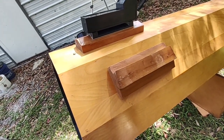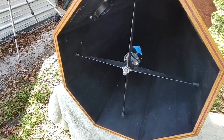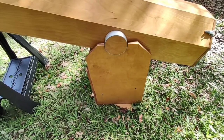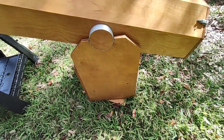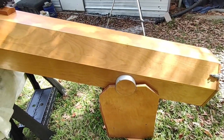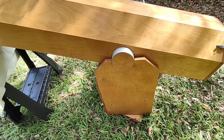I'm thinking there must have been a balance issue and they needed some weight up at the top. The spider is adequate and the secondary mirror holder is adequate — we don't have to do anything with those. The altitude bearings, by today's standards, are very, very wimpy in diameter. They need to be much bigger to provide the right level of stiction you need to overcome slight imbalances, so the telescope doesn't stand straight up or nod down towards the ground as you change out eyepieces. It's going to need bigger altitude bearings.